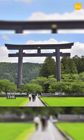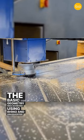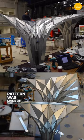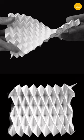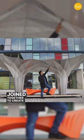How was it made? The basic geometry was achieved using Rhino and Grasshopper, and then metal sheets were grooved so that once the final pattern was made on them, they could be bent and folded similar to how you would fold paper. The whole design was made in modules, so after each module was worked on and folded, they were then joined together to create this final structure.